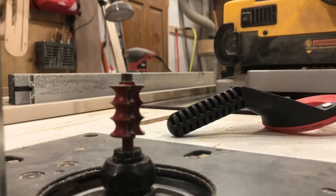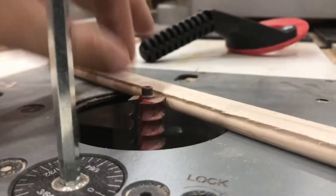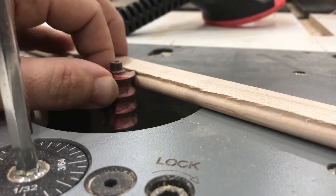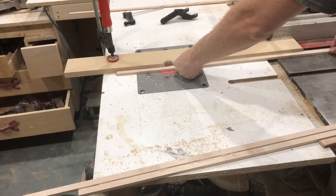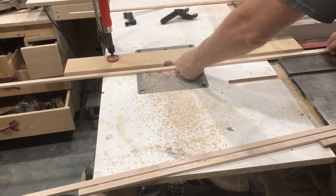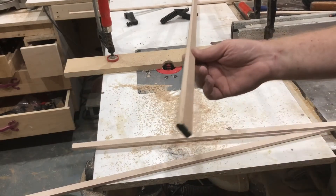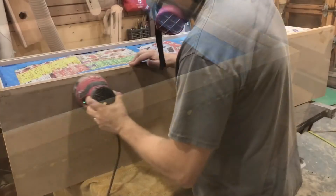The final step to make the trim is to use a triple-bead router bit. I only use one of the three beads — in this case the top bead — using a scrap piece I had as a guide. I don't have a proper fence set up on my router table, so I jerry-rigged one and it does a good enough job. The result is really just a rounded edge with a shadow line all the way around — the same trim I used when I made my kitchen and all the other cabinets in my house, so it's going to match everything else.